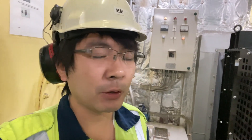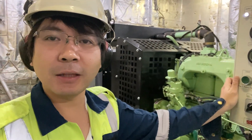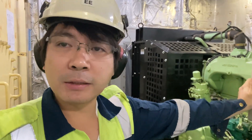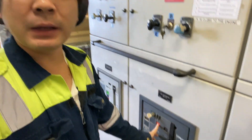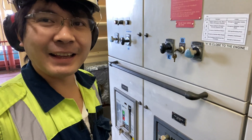That's the other way on how to do the emergency generator load test. But for today, what we will be doing is also testing the allotted time — if our emergency generator will start within not more than 45 seconds. In order for us to do that, we need to open the main switchboard bus tie first. And once we open this one, we are good to go.